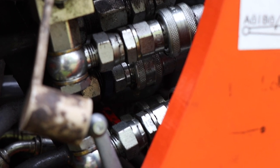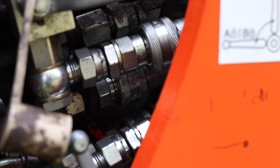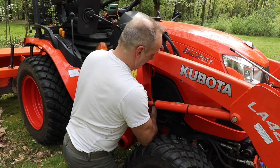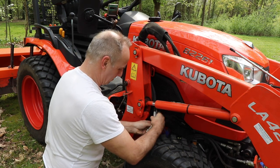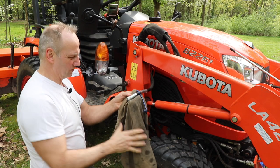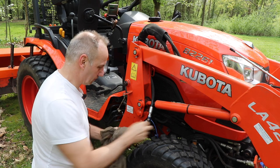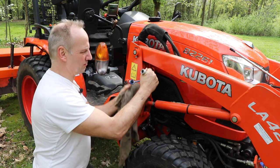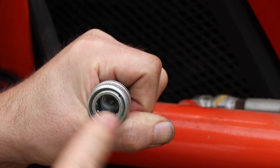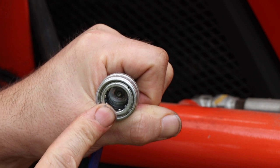You can really see that the blue one is the one that is leaking on top of the others, and it's quite a significant leak as you can see. So I'm now going to disconnect the blue coupling. I'm very sure it's the female coupling, because without the coupling on it the male coupling doesn't leak. So I'm very sure this is the one that's causing the trouble.